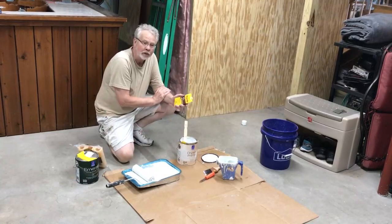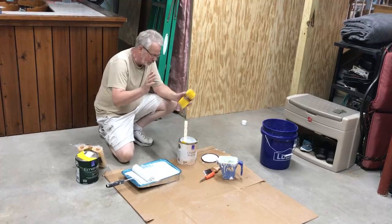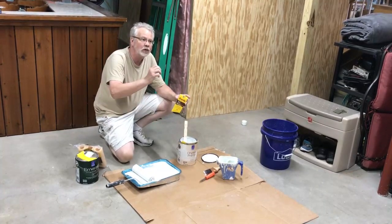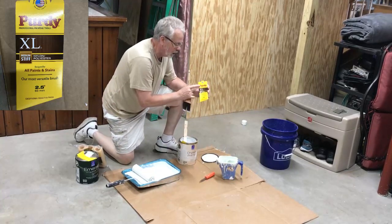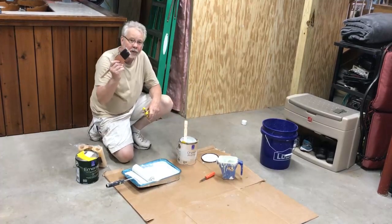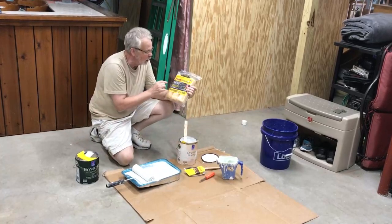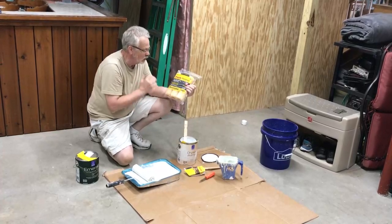We just finished putting a coat of primer on the bathroom. For cutting in, even if you have a lot of trim around doors and baseboard, I strongly recommend a good paint brush. This one's made by Purdy — it's called an XL Medium Stiff two-and-a-half inch angled brush. If you take care of your brushes they'll last a long time, and this is a fantastic brush for cutting in around baseboards. For rollers, Purdy makes a great one called a Marathon. I normally buy the three-pack. I use a 3/8 nap — this will give you a nice smooth surface on the wall.